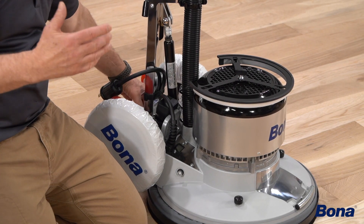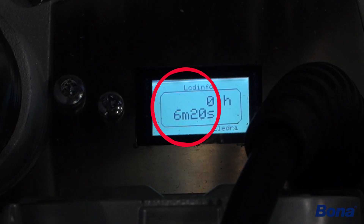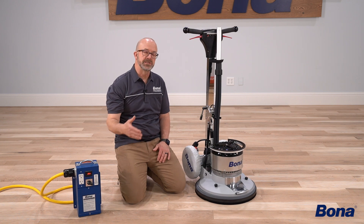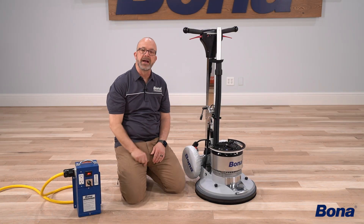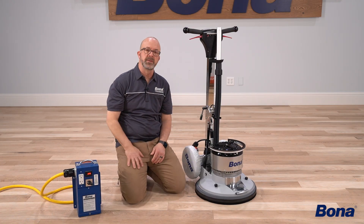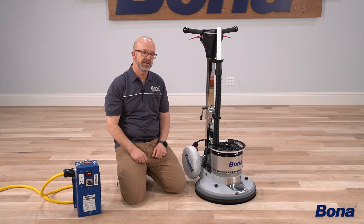This is also for people who have older models of power drives - check your machine specs and plates. Very early models of power drives were wound for 220, and all the later models are wound for 240. You always want to run as close to that as possible. If you've got one of the 220 models, even though it could run on 230, you may want to dial that back a little bit. If you've got one of the 240 models, on 208 the most you're going to pull it up to is 230. Know what your motor is wound to, use that multimeter and all the information it can give you, to make sure your machine is running the best that it can.